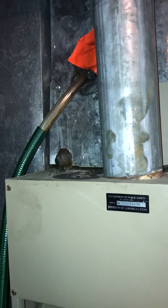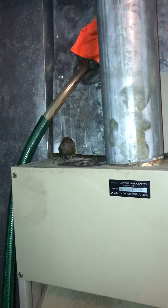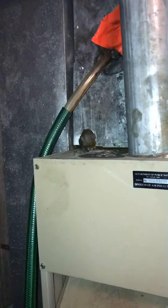I'm going to validate the number of supplies just to make sure that everything's sized correctly. It looks like we've got a two and a half ton unit outside, so I'm going to validate that that's the correct size for the house.